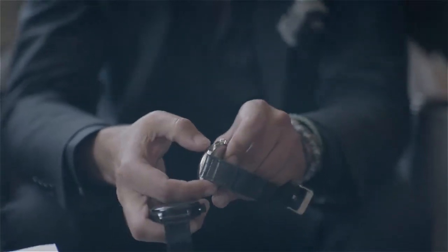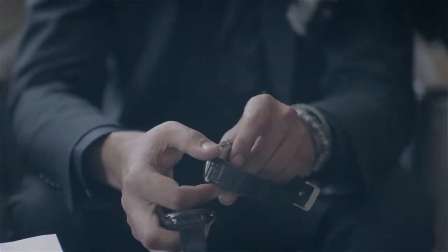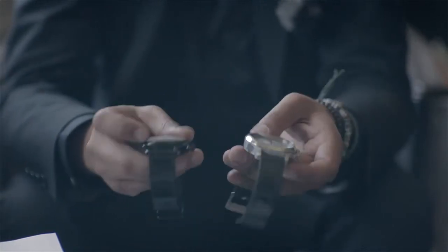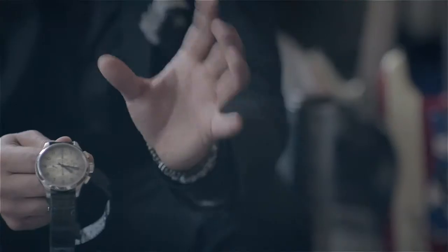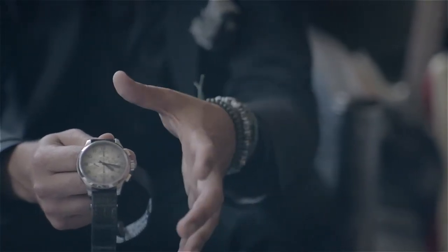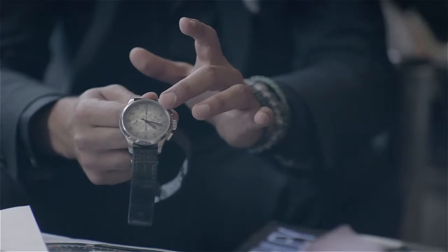To do square pushers you have to completely rebuild the case. Since we were already reworking the case, we made the lug more angular to match the finish of the bezel and the pushers. Our dial is painted flat — it's this idea of the perfectly imperfect. Growing up doing restoration, patina is something very special that forms in non-water-resistant watches, specifically in those vintage chronographs with square pushers. The dials would darken from the outside in, and it took a long time in Switzerland to develop this technique, as well as even illumination.